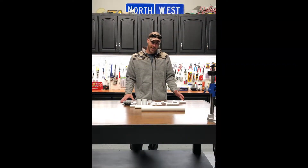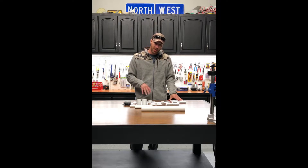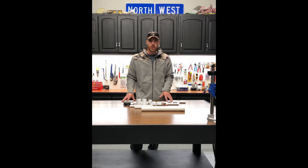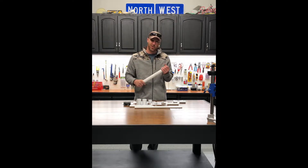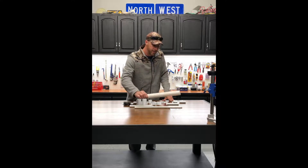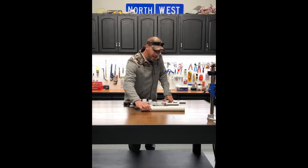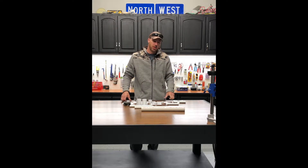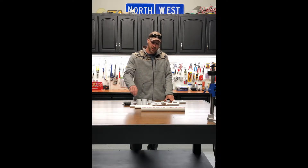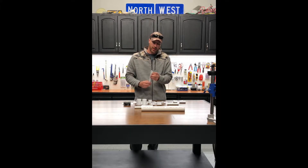Welcome back, it's Capital Goat Hunter, and as promised we're going to work on a smaller hand dredge. As opposed to the two-inch hand dredge from the last video, this one's going to be an inch and a quarter with an overall length of about 26 inches. This is going to help you get into tighter areas on the creek bed, in cracks, behind boulders — it's going to get you smaller material because the smallest opening is about a half inch, so you won't get anything bigger than about a half inch inside the tool.